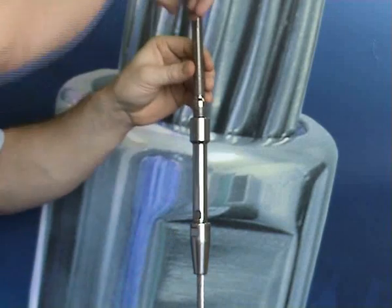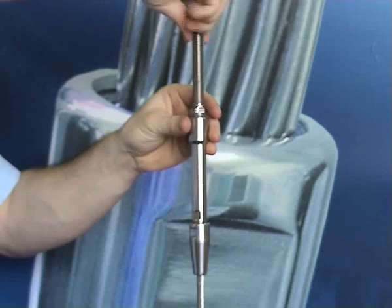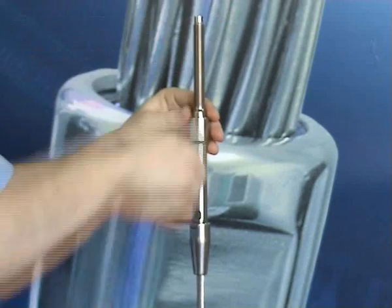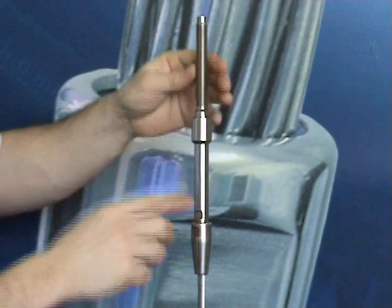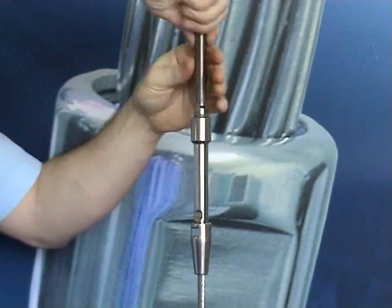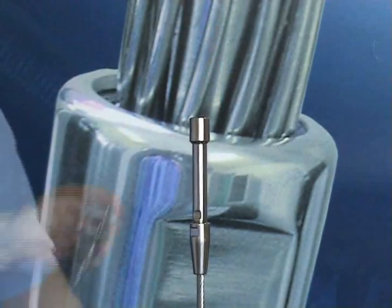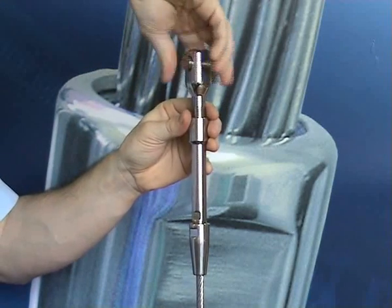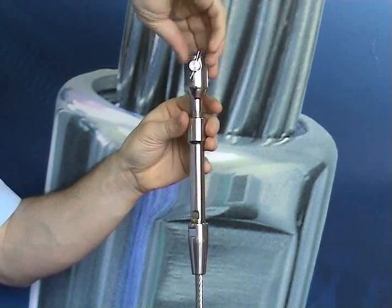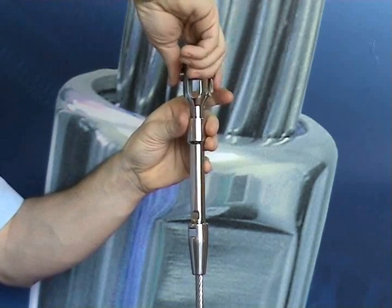This is very useful for repairing broken backstays while sailing. By having one compression terminal and one extender on board as an emergency repair kit, you can ensure the repair of your backstay at any time. The extender is a one-fits-all component and can be used with a stud, eye, fork or toggle compression terminal.